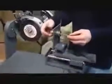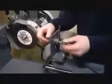I'm going to demonstrate how to sharpen up a hole saw using our AV40 and our hole saw fixture. First you loosen up this wing nut here, take the spring off, and bring the slide away so you can pull the center pin out.